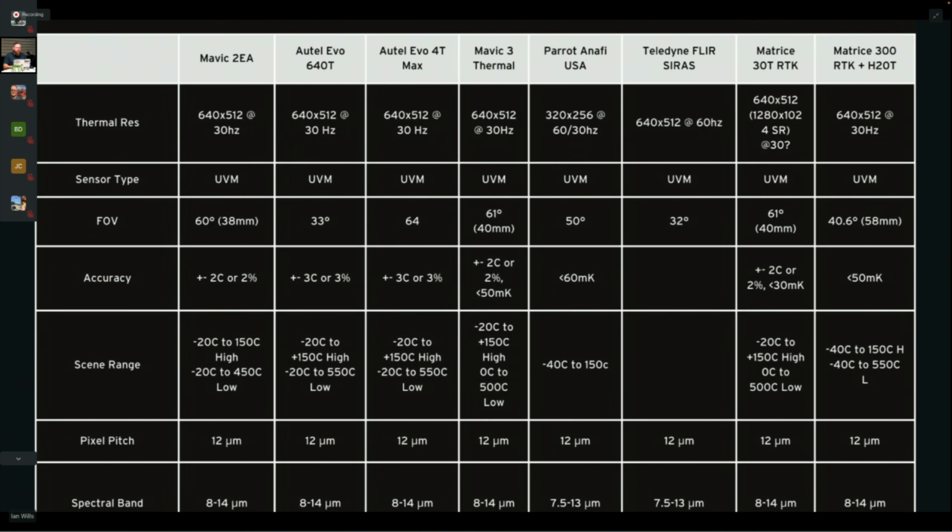So then the differences start to happen in the level of field of view. So 60 degrees, 30, it's not zoom as much as there's a little bit of magnification happening. They each have different thermal lenses and it's sapphire glass. So it's a different type of lens, and you might have a little more magnification depending on the drone. So that's where you start looking at what level of detail, at what distance do I need to be to get that minimum level of sensitivity and image size. The narrower the field of view that you see on the thermal camera, the higher the level of magnification.